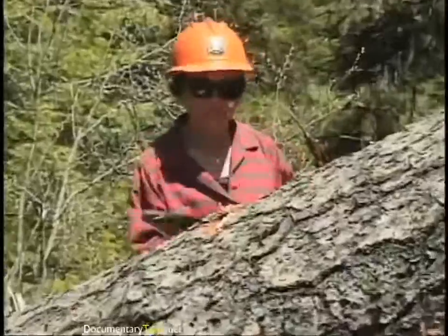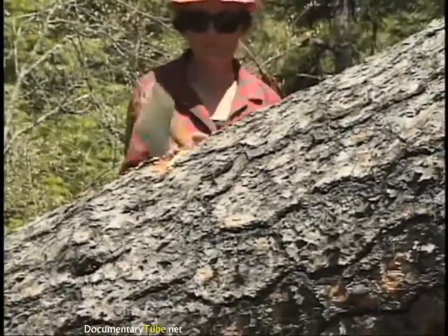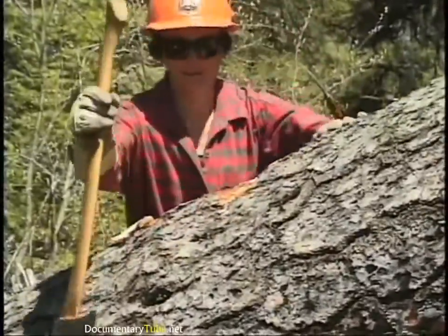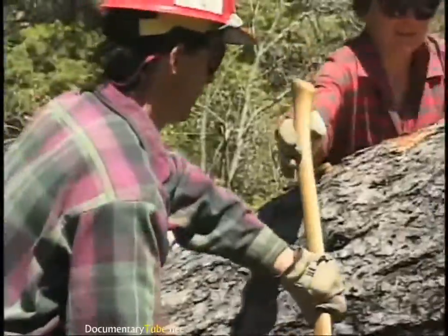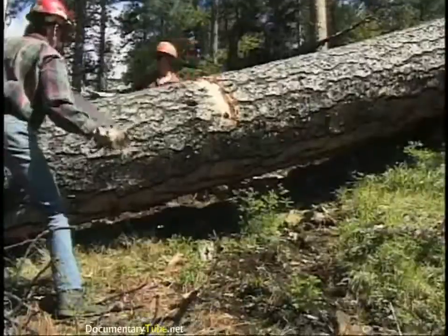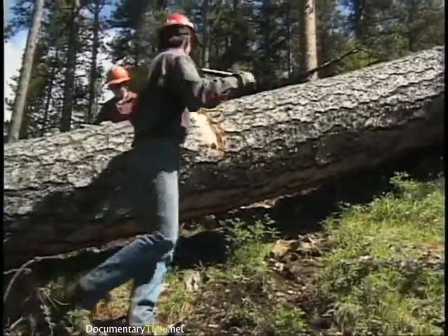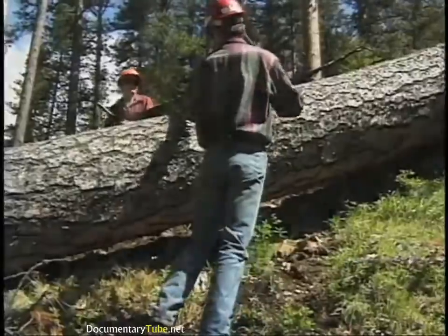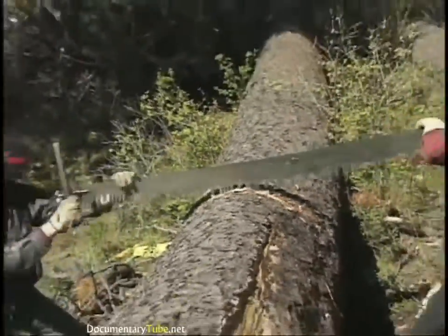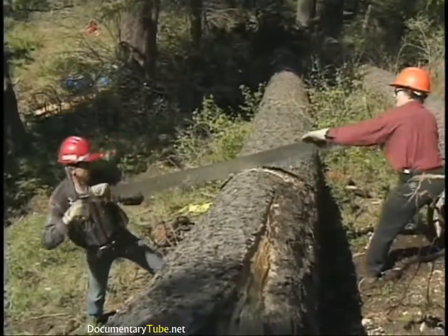Then if the tree has thick or dirty bark or charred bark, you are doing best to chop that away with an axe so you won't dull the saw. Then you unsheath the saw and put the sheath where you can find it and hand one end of it across the log to your partner. Get in your positions. Start pulling gently. Sometimes one person needs to reach out and kind of guide the center of the back of the saw until the cut gets started.